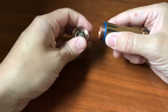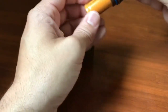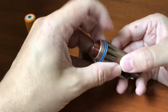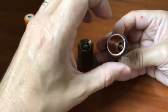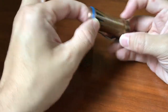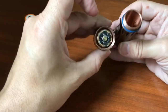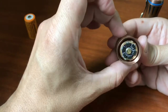Let's take a look on the inside so you can see how thick the copper is — this thing is massive. One thing that's strange is that these aren't the beefiest threads I've ever seen. If you compare them to the threads in something like the Boss 35 or the HDS Rotary, you'll see the threads are a little beefier. But the thickness of the wall on this is just incredible — we're talking, at its thickest point, close to at least an eighth of an inch thick. And here you can see the rear end of the electronics — they are very, very nicely, cleanly done.